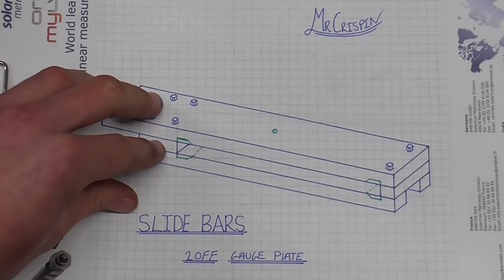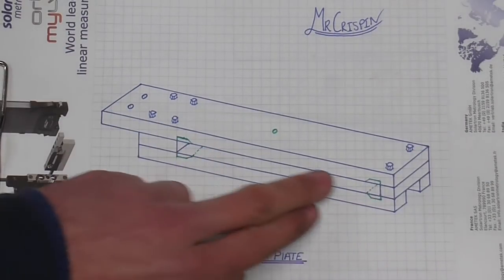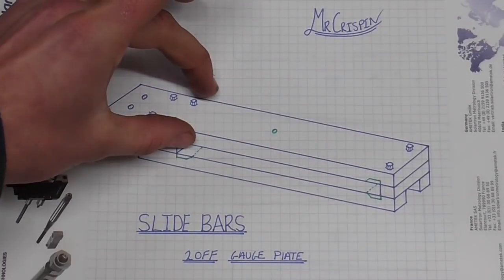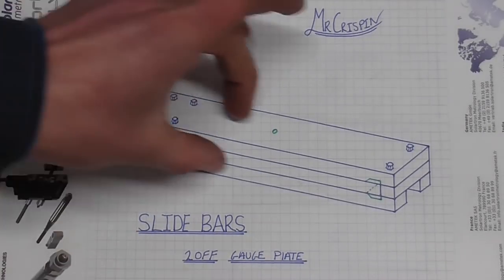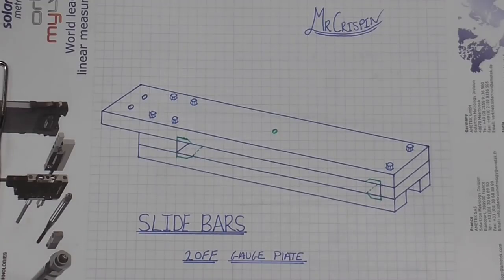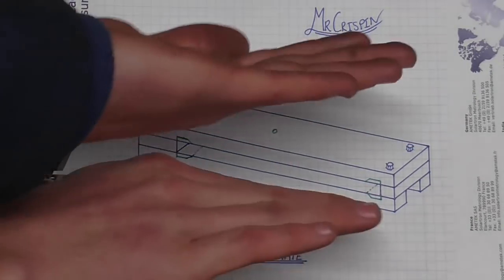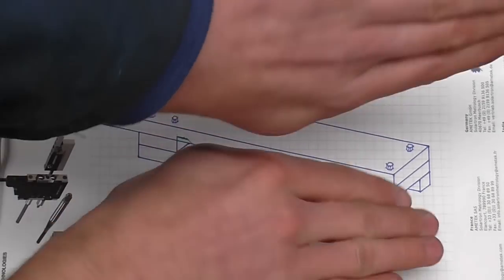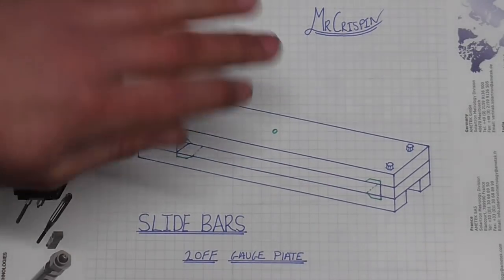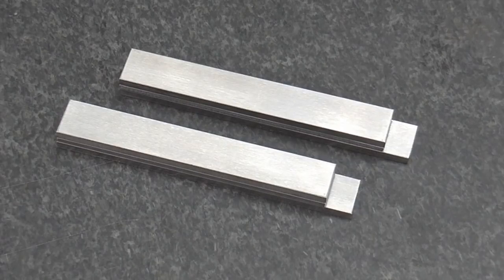The cross head mounts in the middle of this component and has two tangs that run down either side of these rails, so the cavity created in the middle has a tang running in it - that is the motion of the cross head within the slide bar. Considering that running motion and the fact it needs to be well supported, I'm going to position the plates so that the bows are both inwards. That will hopefully allow some amount of support, compared to mounting them the other way around which would give less support. Of course, we are talking about very small amounts of bow. I've made my decisions and now it's over to the milling machine.